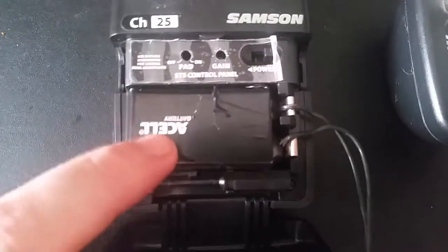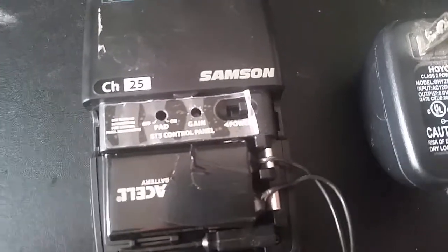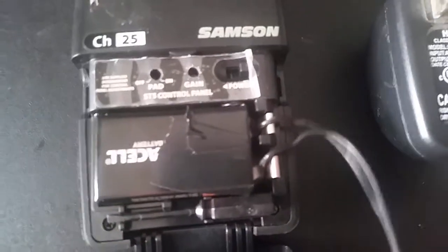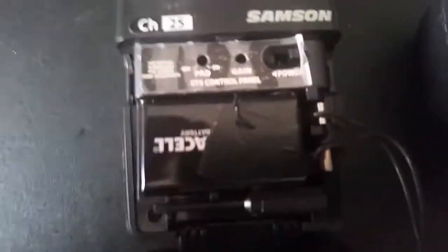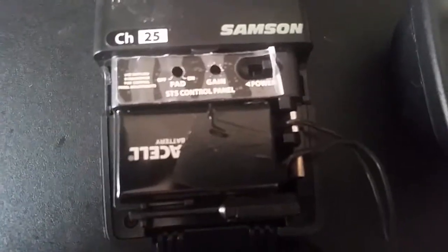It's a really simple way to make a wall adapter work for your 9 volt device. Now if your 9 volt battery uses clip-on ends, you might need to buy a clip-on connector so you can reverse that and attach it to your wire — but the principle is exactly the same, just one extra piece. You can probably get those at Radio Shack for super cheap.